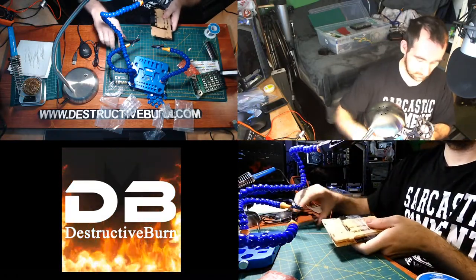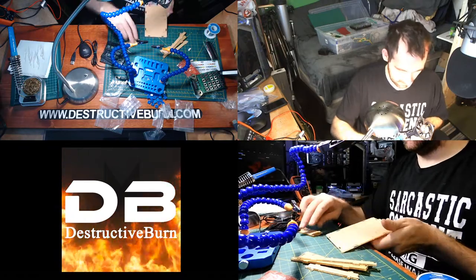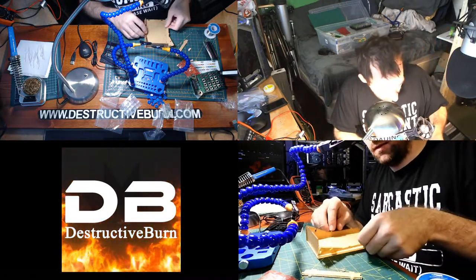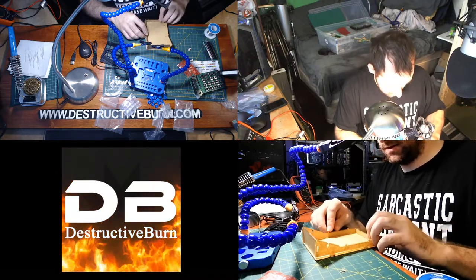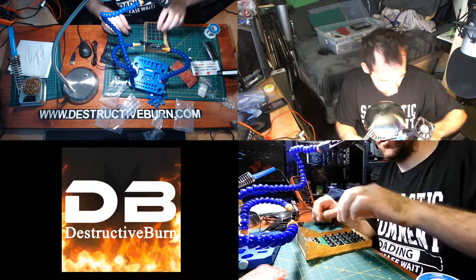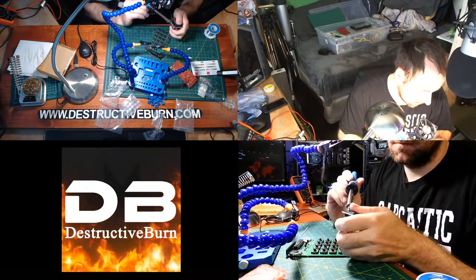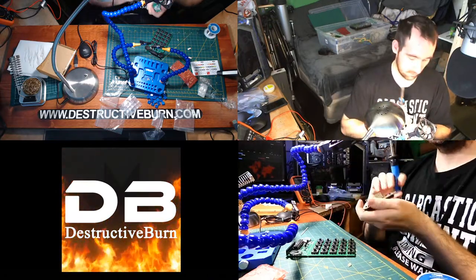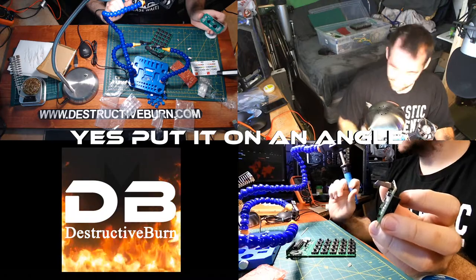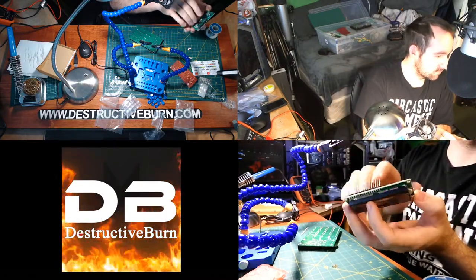I hate the paper stuck on the acrylic but I'll keep everything in its paper for now — I just want to see how it sits. The board goes on at an angle. I'm going to angle the soldering iron from the side to avoid putting stress on the solder joints. Just clamp it and solder the rest of the points in.